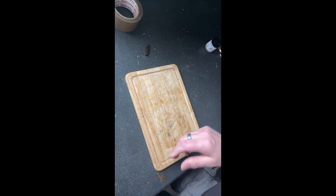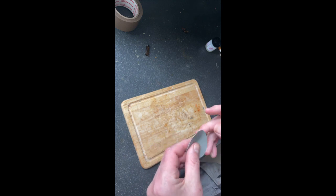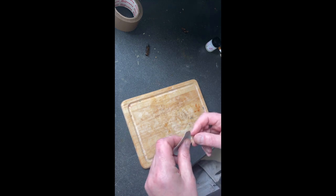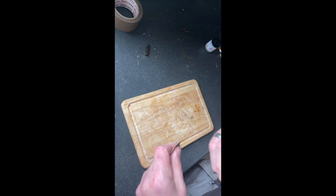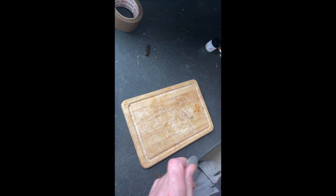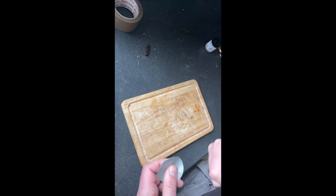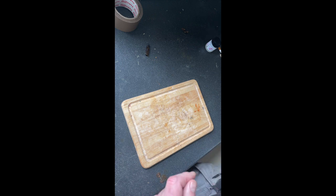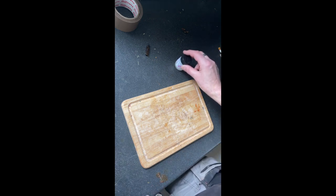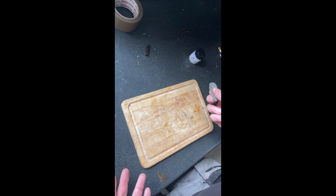There's your patch. A good point to note when repairing your tubs: if you have a previous repair, or if someone has used a bike repair kit, Storm Shore, or any other product, you need to get that product off the surface you're going to repair. This two-part kit needs to go directly onto the tub, otherwise your repair is only as good as the repair that was there before.